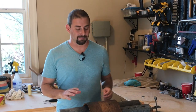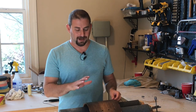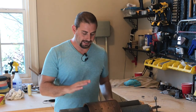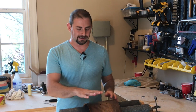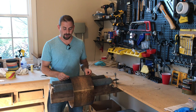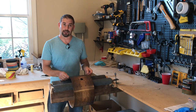Okay so here we are at the final step and what we're going to do is polish these drums out. Now I found that no matter how careful you are and how much you really take your time and apply those last few coats of polyurethane, especially the wipe-on stuff, you can't help but get little dust nibs and little hairs and things inside of the finish. And whenever you see a nice finished drum, you really don't see any of that stuff. So the trick is to rub out or polish out the finish once it's all done.